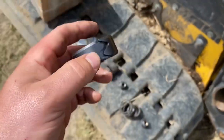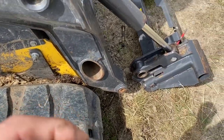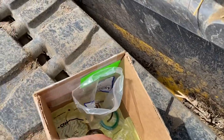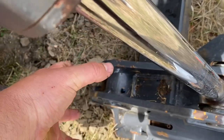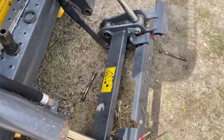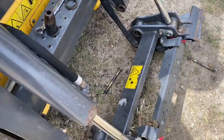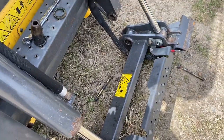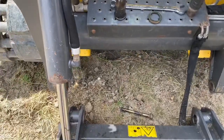I'm going to drift these in — the new springs — put the new seals in, and I've got some grease to clean out of there. There are also dust caps that go on the outside, though they aren't in this box. The dust caps go on the inside and then they're greased through this fitting, filling it up almost like a wheel bearing system — completely sealed from dust. Because this is always in material, aggregate, whatever — if you get sand or dirt in with grease, it turns into an abrasive and will wear your pins out.